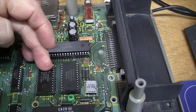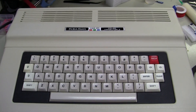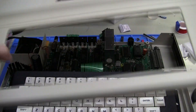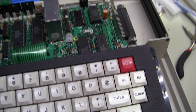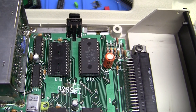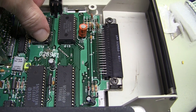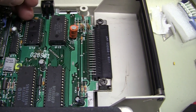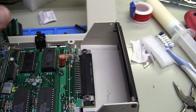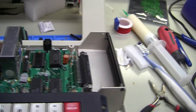If I'm going to make a single board to fit both sockets simultaneously, it's got to adjust for the two different widths and also account for the swapped left and right positions. What about in a Color Computer 2? With the introduction of the CoCo 2 - I believe this was the first model with the melty keyboard - let's check the situation on its ROMs. Still two sockets, similar gap - I think if I could come up with something for both CoCo 1s, it would probably work here also.